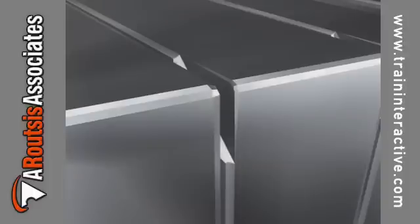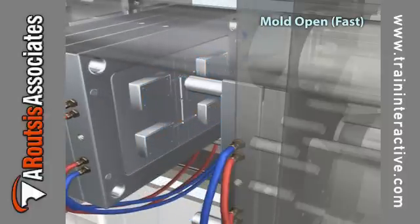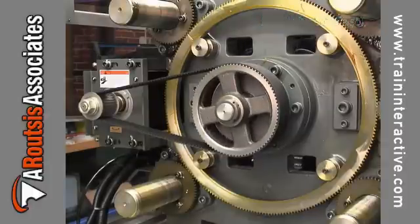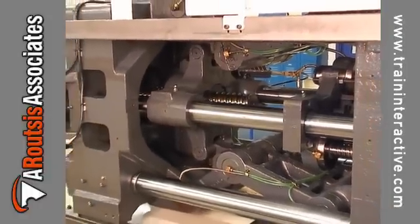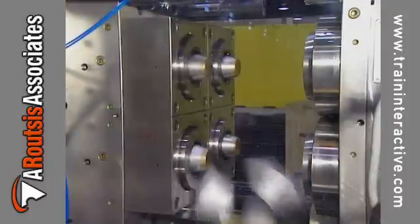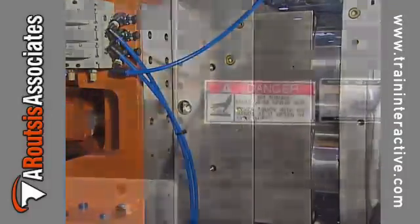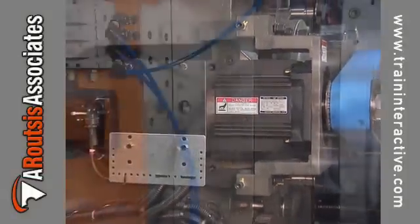After the part and leader pins are cleared, a significantly higher mold opening speed should then be used. The speed, accuracy, and reliability of electric servomotors allows you to make the final mold opening quickly. Many molders choose to use the fastest speed available. Since servomotors on electric molding machines are very responsive, a slowdown before the mold open set point is typically not necessary.